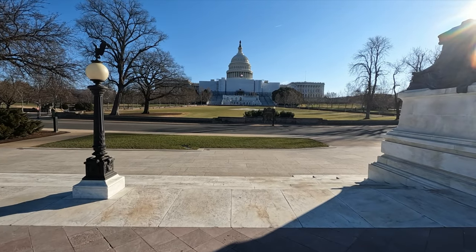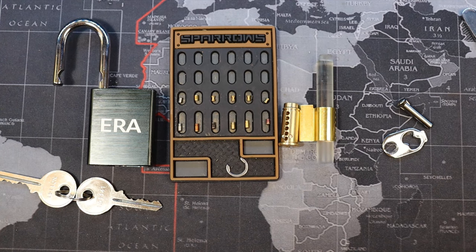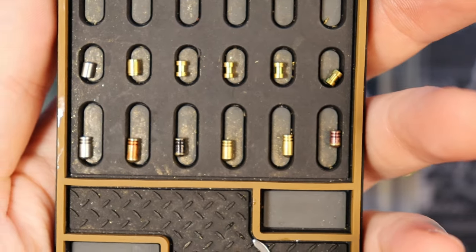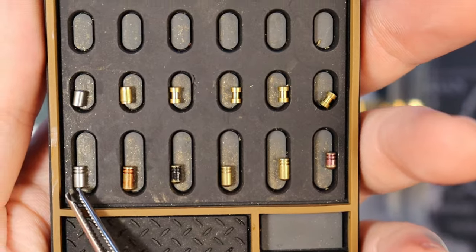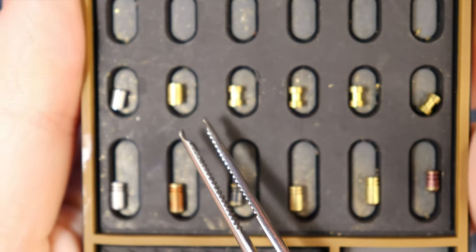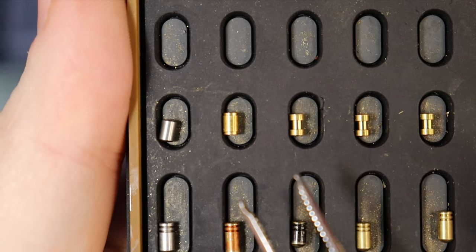All right everyone, I'll be home soon to get that for you. All right, I'm back home and I already have this gutted. It's a pretty simple gut. Here we can see that we have all spool pins along the top here, steel pins in the first chamber with the serrated steel on the bottom. And we have a somewhat tapered pin in chamber number two right there. It is more of a straight taper than a smooth taper.